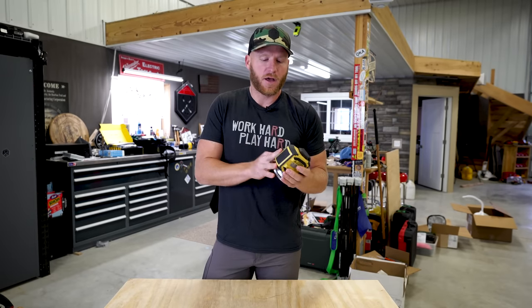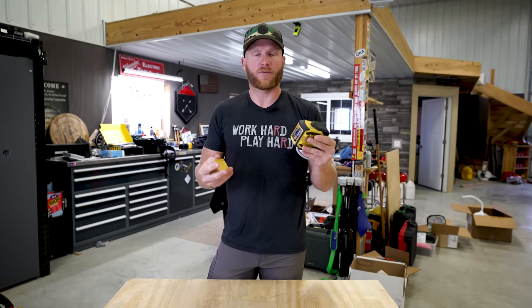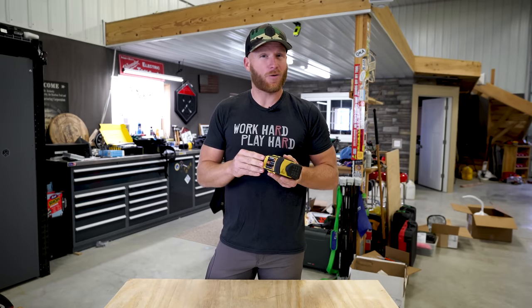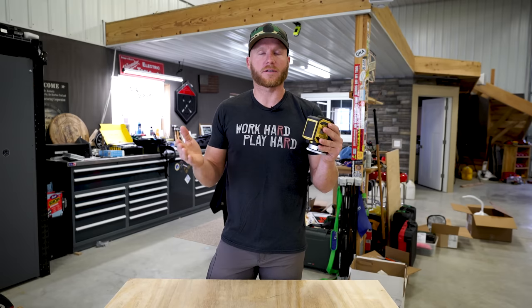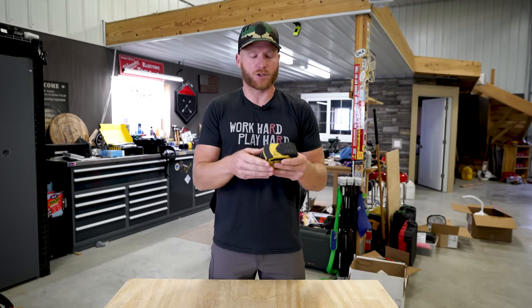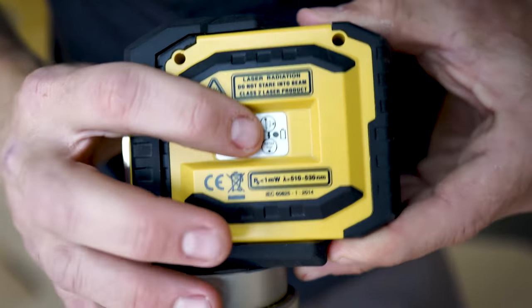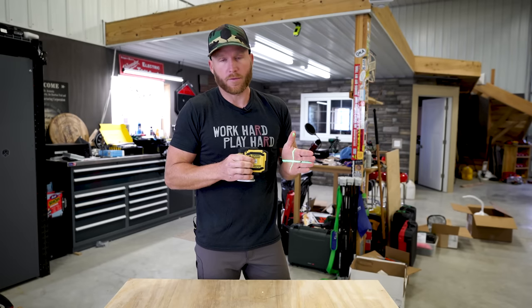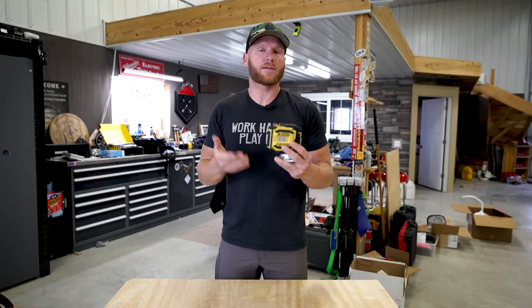It's going to operate off of three AA batteries. This is the one spot where I think Stabila has growth potential because they're not a power tool company. They don't have a battery platform system, so they're working off of AA batteries. It's not the end of the world — you get about 15 hours of runtime. Temperature will affect that, so in the wintertime these batteries aren't going to last as long, but no batteries last as long when you're working outdoors in freezing temperatures. The nice thing is they give you the option to change between full-on, every diode in operation, to a straight plumb line, horizontal line, or all three at the same time. So if you don't need all lasers at the same time, you can turn the ones off to save yourself some battery.